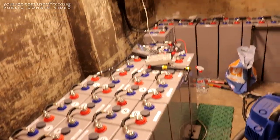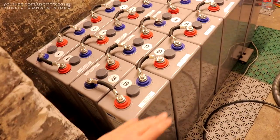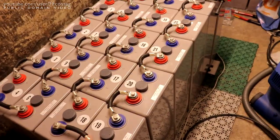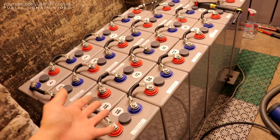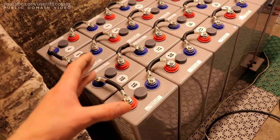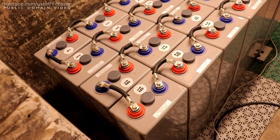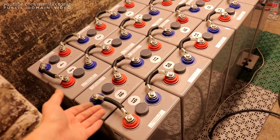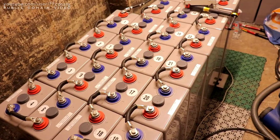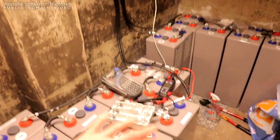That's just mechanical work I can do myself, as long as I have help actually wiring it up properly with someone who's got proper credentials. I'm also looking at solutions for covering these batteries - I don't want the terminals exposed. I'm thinking I'll get some clear acrylic and build a wooden frame around them, with clear tops so you can visibly inspect them without getting killed if you put some metal on that. I'm actually not sure if the inverter I'm going for has battery isolation - I strongly doubt it, since that would require a transformer inside. It's much easier to do it with chokes and not have the batteries isolated, so I'm expecting these to be at mains voltage once everything's wired up, even though it's nominally a 48-volt system.